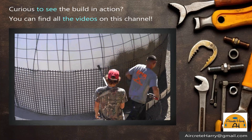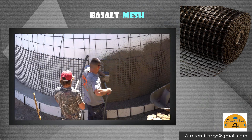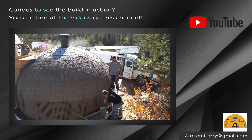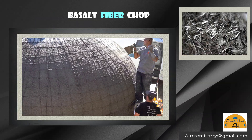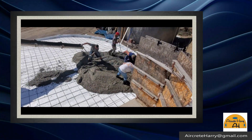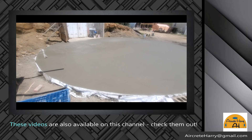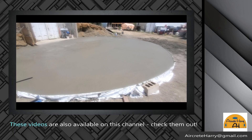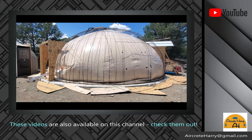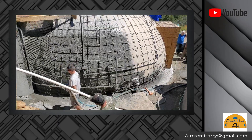This is the 16-foot dome — this is a bathroom dome. In this structure we were using basalt mesh, basalt rebar, and basalt roving, so we're using three different basalt products including basalt fiber chop mixed into the cement — really four different reinforcing materials. The idea was to stay away from metal in the structure. Here we're working on the 30-foot slab for the 30-foot dome we're going to be building, and this all went really smooth. The beauty is these are really fast structures to build when you know what you're doing and are all ready to build, and they're also really inexpensive.